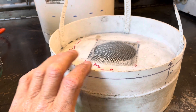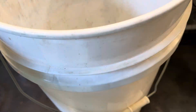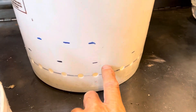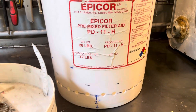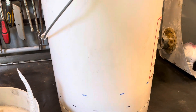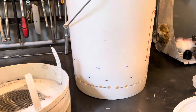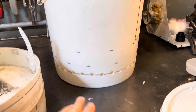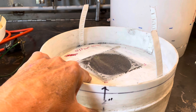This sits down in the bottom and that's your charcoal bed. Inside there's some filter material — just a roughing filter, basically batting-type material — on the bottom. The inlet is down here; I drilled half-inch holes all the way around, one inch in a row, about two inches off the bottom. This is a seven-gallon bucket so it's taller; if you go with a five-gallon bucket you may need a shorter HEPA filter. Airflow comes in through the holes, up through the roughing filter and batting, then through the charcoal bed.